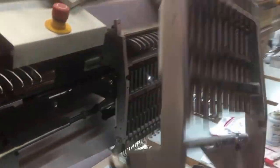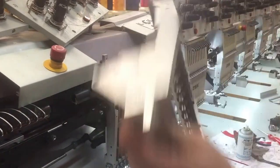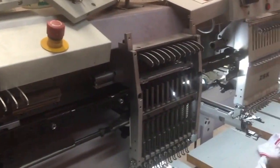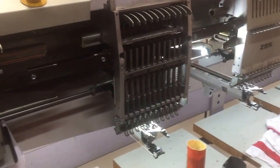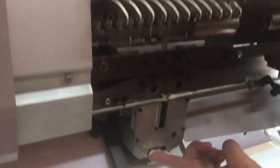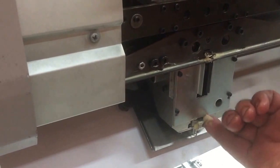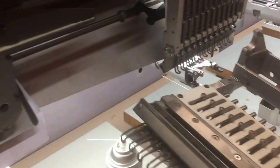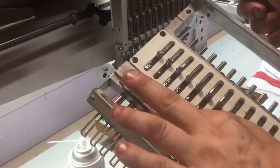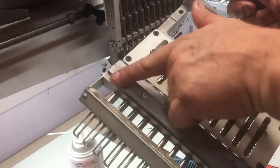After that's cleaned, all your needle bars should easily fall and rise. Quick wipe over for any excess. Good. Touch of Glycomo just on either side of this nose here. That runs on this machined bar, ground bar. So a tiny bit just on there as well. See the witness marks at each point of the colour change operation.